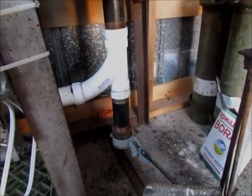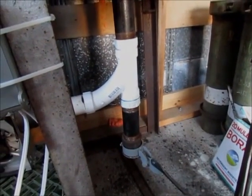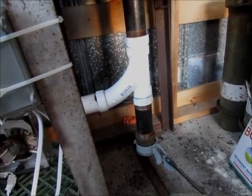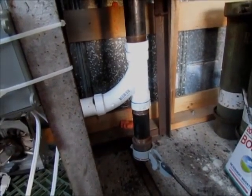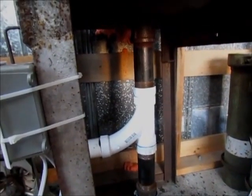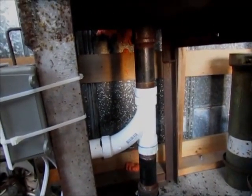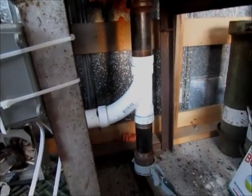My tee is a sweep made out of PVC, and I was worried about it melting. I said, well, I'm going to try it, and if it melts I'll just do something else. But surprisingly it hasn't melted — it's about eight inches below the heat. That pipe gets hot but not hot enough to melt, and I haven't smelled any burning plastic, so if it keeps working I'm just going to leave it alone. It really does good airflow.